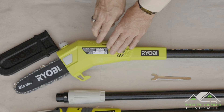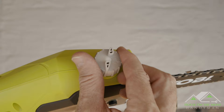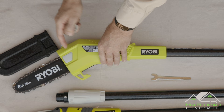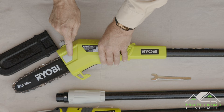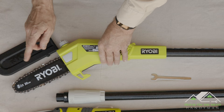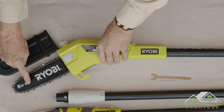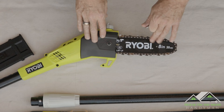Right on the head of the cutting pole you'll see a white knob — that is where you fill your bar chain oil. This little window right here is the indicator for how much bar chain oil is remaining. One thing to note: this box doesn't come with any bar chain oil, not even enough to get yourself started, so make sure before you leave Home Depot, or if you're ordering online, that you also order bar chain oil. It's essential — it lubricates the bar and the chain so excessive heat doesn't build up, which could ruin your unit.